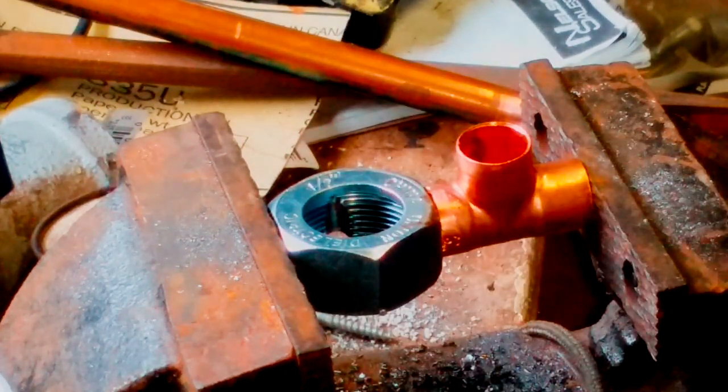What I'm going to do is use the spot where we have solder on it — that's the spot we tinned earlier — and we're going to clamp it together. We know that the center line measurements from here to here are one and seven-sixteenths, which is what the print calls for.